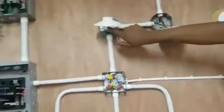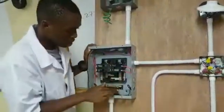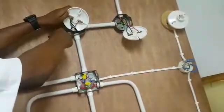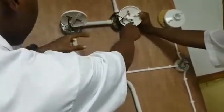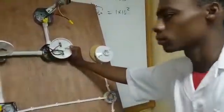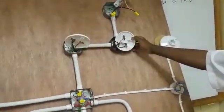Now we use a 1.5mm square black wire. We connect it here to the breaker panel at the neutral bar and run it to lamp 1. We looped it there, then continued and stopped at lamp 2. So we screwed it down on lamp 2. This is the neutral part — the return. The return from here comes to the neutral part.